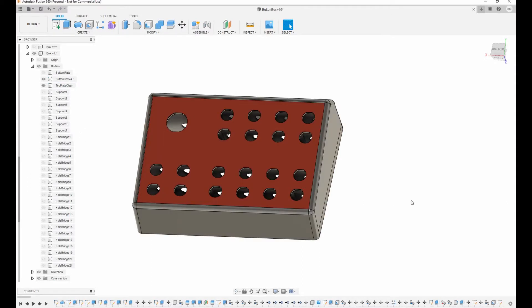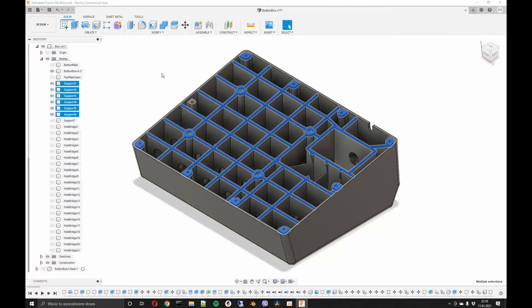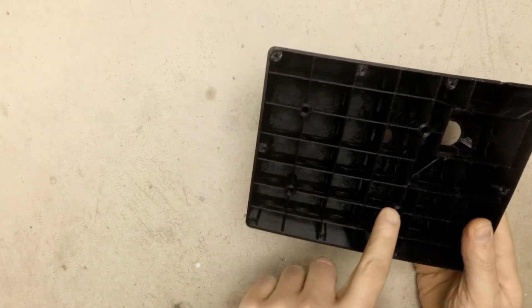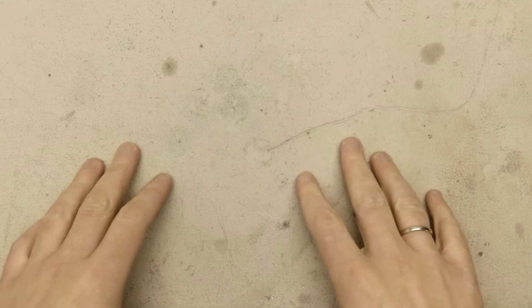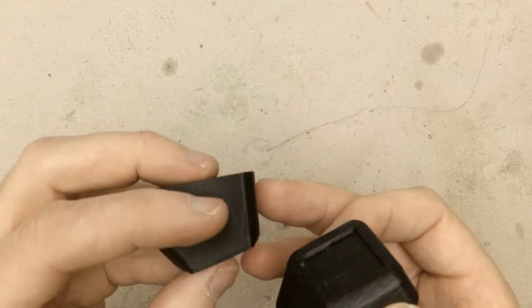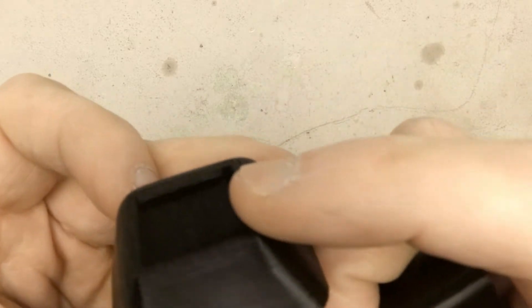There's also an optional extra top plate which adds an extra finishing touch, especially when printed on a textured PEI sheet. I built in supports for the lattice and made recessed holes for the buttons for easier bridging. I also added 4 holes for threaded inserts so the whole unit can be easily mounted to any surface using M4 screws. After designing the box in Fusion 360, it's a good idea to check if everything works because this is quite a big print. So I printed some simple test parts — two identical parts where one was printed bottom side down and one top side down. The top side down orientation gave a much smoother top plate, so I will use that orientation for my final design.